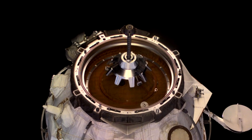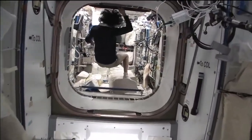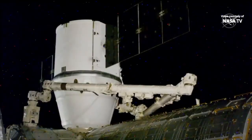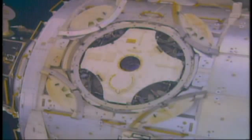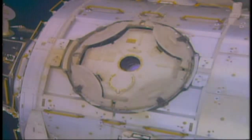The international side of the space station is held together by using the large common berthing mechanism adapters. When you see the square hatches on the interior of the station, that's when two modules have been bolted together using the CBMs. Now the CBM isn't suitable for free-flying docking maneuvers. It requires that one of the modules be grabbed by a manipulator arm and then carefully placed in contact in the right location and slowly mated and bolted together. Larger docking systems actually have problems with thermal expansion, so the process is intentionally slow to make sure that both sides reach equilibrium and line up correctly.